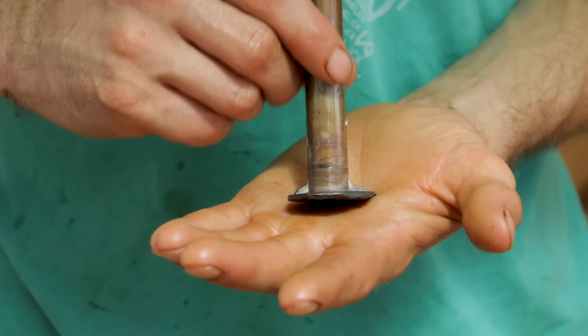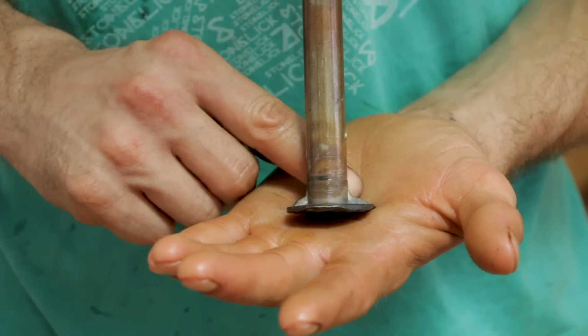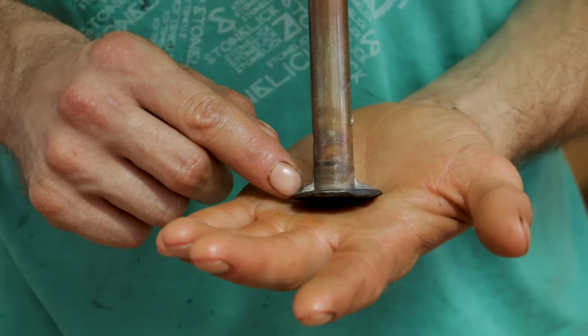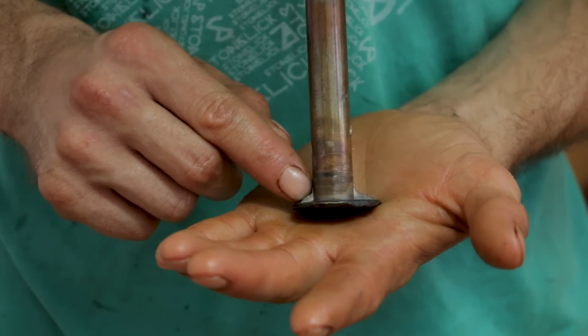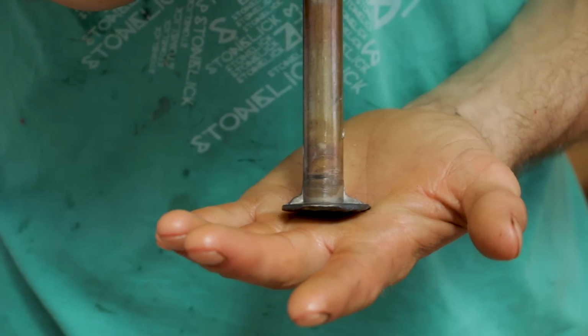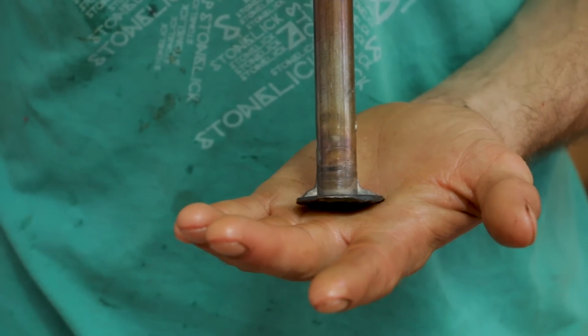And the idea is you drill a hole the size of the shaft, you put this in, we can shape this head a little bit if we need to alter its size. And then when it starts to pull tight, these little wings here get locked into the oak and they keep it from spinning. So it's the same principle as a carriage bolt. This is just a homemade version of it. It's called a fin head bolt.